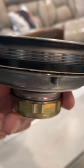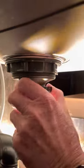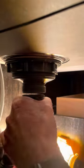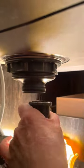First thing, of course, is to remove the old drain. Underneath the sink is where all the work takes place. First thing we're going to need to do is remove the tailpipe. Most of this stuff needs to be just slightly more than finger tight, so it'll come right off. I'm going to slide the tailpipe down so that it's out of the way.